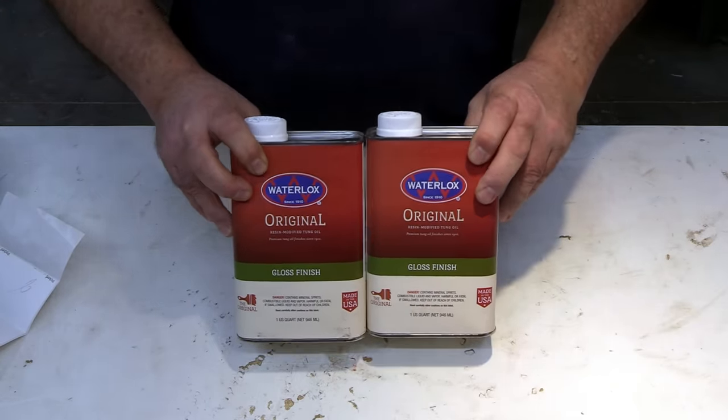So I just cleaned up the bottom a little bit, and then we'll be able to move on to some sanding here. These are the 3.5-inch dipple discs from sandpaper.ca. Absolutely love these discs. Highly recommend them. They're a great price, great value for what you pay for them. And this was sanded from 60 to 180. And we've still got some little voids to address. But overall, I'm actually really surprised at how little fixing I had to do on this piece.